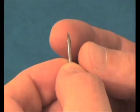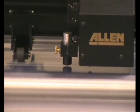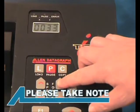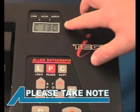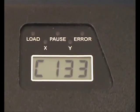The material is cut using a 60 degree angle blade that resembles an exacto knife. The depth of the cut is determined by how much pressure is applied to the knife. Using the up and down force keys will change the depth of your cut — the more the force, the deeper the cut. The two right-hand digits on the display are your actual force settings.